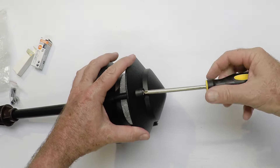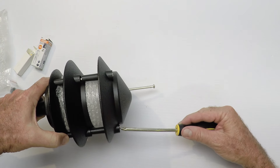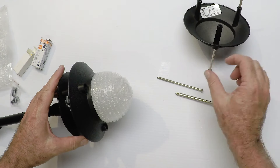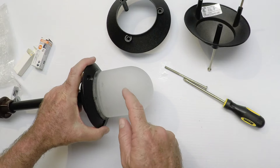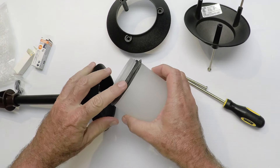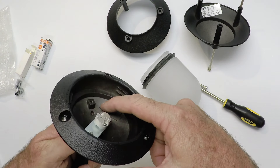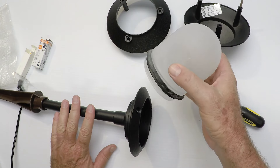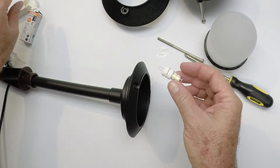This is a serious glass lens — not a cheap plastic thing that's going to deteriorate in a year. If it's not broken, it'll last forever. Let's open this up. Take a screwdriver and loosen the screws; if you hold it upside down the screws just fall out. This section slides right up and off. There's the glass inside — we call this a jelly jar. We sell replacements on our website because people end up breaking them. It has a gasket here to keep moisture from getting inside, and if moisture does get in, there's a weep hole down in here that allows a little moisture to get out while keeping bugs from getting in. The glass diffuser takes the light and diffuses it out really nicely, because we want a soft look when lighting pathways and gardens.